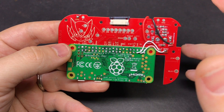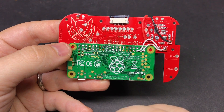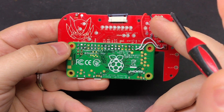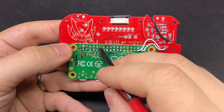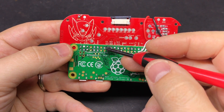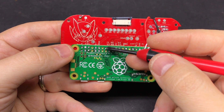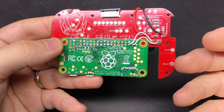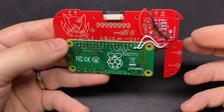Something else he added was an easy way to manually trigger that safe shutdown without even having to jump out of whatever game you're in. You can do that by attaching a tactile switch or some other kind of button to this GPIO pinhole right here — it's the 8th one in from this side on the outside. You attach one leg to a ground pin, and then the other leg to this pinhole. If you hold that button down for a second, it'll automatically start shutting the system down. That's a new button you're going to have to add somewhere on your MintyPie.